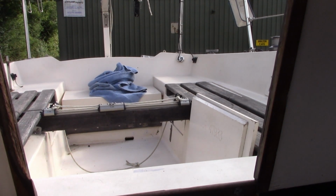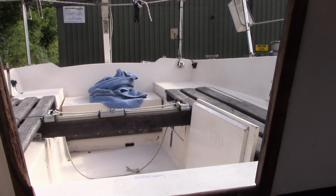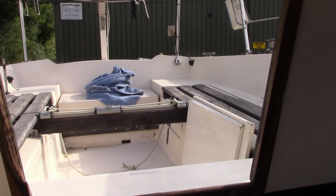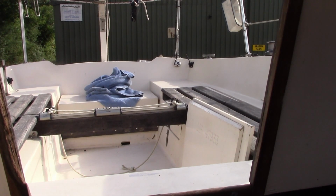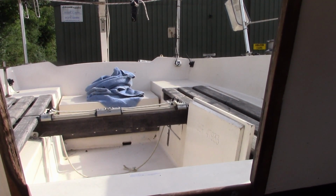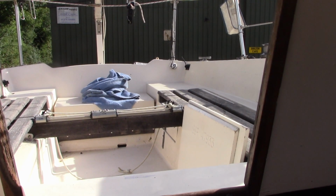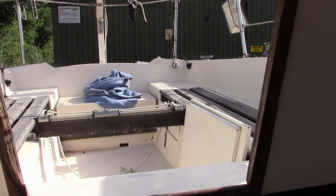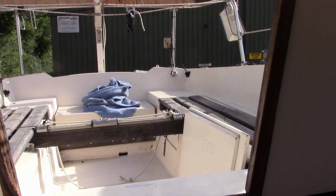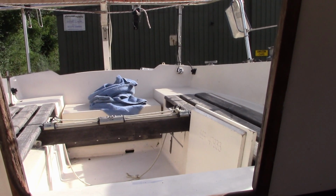Well, there we go. Yes, of course, that we saw earlier, that copper coat hull, which really makes life very easy, particularly on this east coast where we tend to be regarded as one of the most fouling rivers, as in hull fouling. The rivers are clean enough, but there's a lot of hull fouling down here, and it really does last about 2 months, whereas anti-foul lasts about 1 month before needing to be cleaned off.